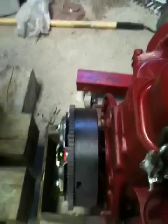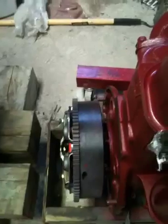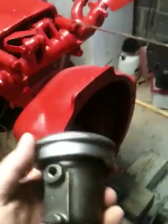It looks like a brand new motor, and this valve cover was off the Super A — it cleaned up real nice. Also from the 140: 140 flywheel. When getting the old ring gear off the Super A flywheel, we ended up cracking it, so we got a new ring gear. As you can see, I got a brand new clutch, a new throwout bearing, and cleaned up the housing.